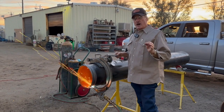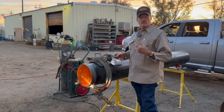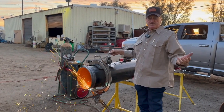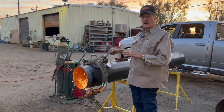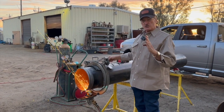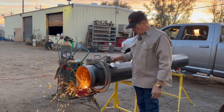If this pipe is not hot enough, the flame is going to want to skip out because the metal can't burn — it's not hot enough to burn. It's just going to skip out and you'll hear it make a sound. When it starts doing that, it's trying to tell you to slow down, because this pipe, you can get it hot enough, and I'm going to jump out of here in a minute. When it jumps out, you've got to back the torch up to where you started, let it heat up, and then start over again.